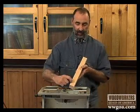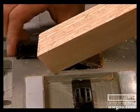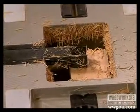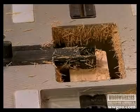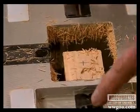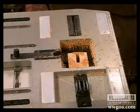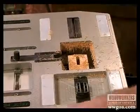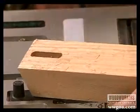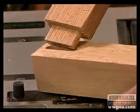When the leg comes in, I've also got the center of the mortise located on the leg, just like I had the center of the tenon on the rail part. Bring the bullseye forward again. With the table loose, I can locate the bullseye now over my mortise. Lock the table. This time, I'm just going to let the pins follow these guides. These cuts result in a round-ended mortise from the router bit, and also a round-ended tenon because of the way we followed the guide.